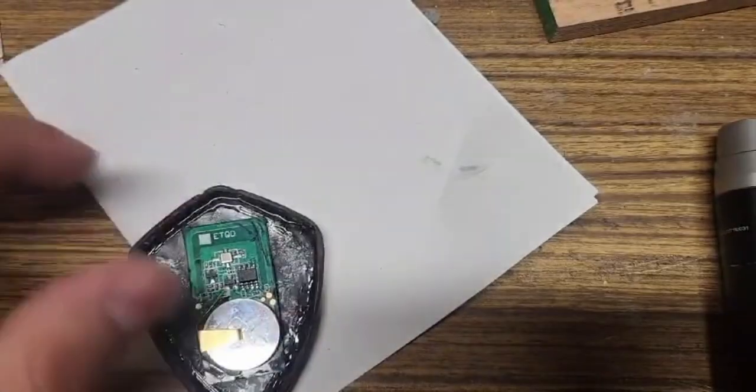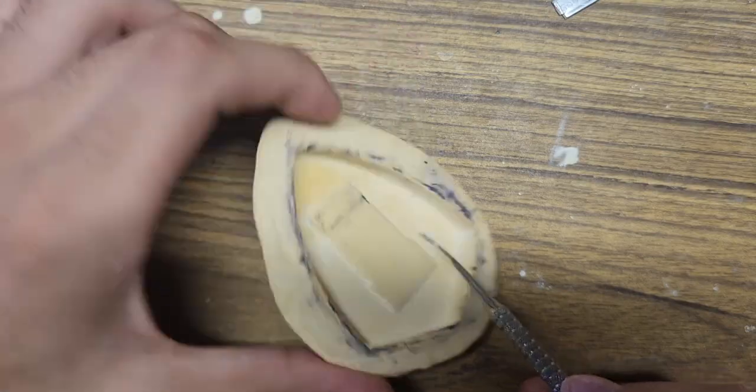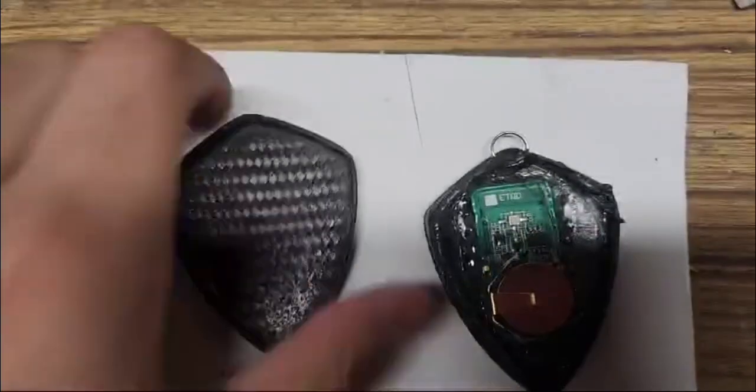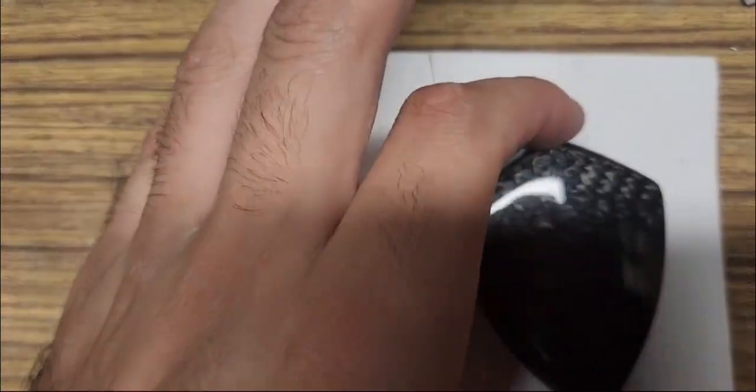To give a quick introduction: I will first acquire a 3D model of the general shape that I want, then 3D print and modify it so that it can house the functional parts of my old key fob. Then I'll create a compressive mold from dental stone. Lastly, I'll layer the mold with pre-preg carbon fiber and bake them to get two shell halves that I can assemble into a functional key fob.